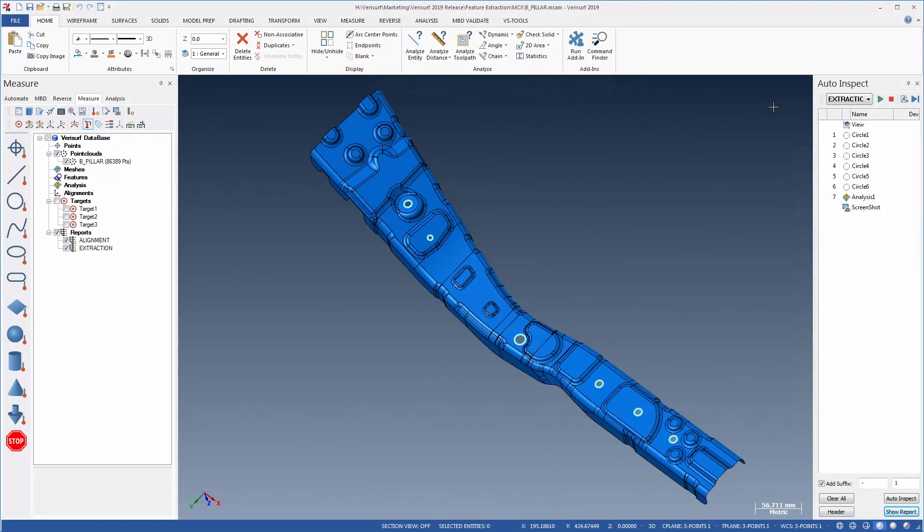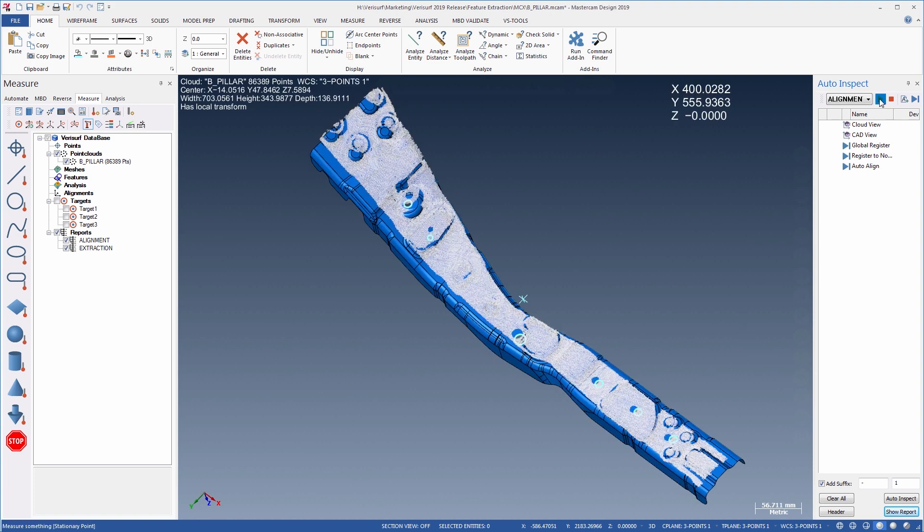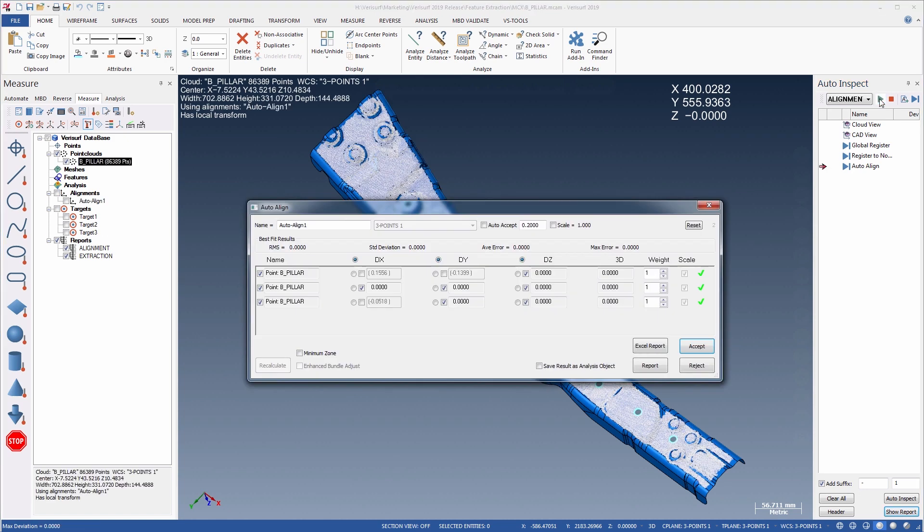Let's begin with an example of a sheet metal part that's been measured with a non-contact scanner to create a point cloud. We're required to check the locations of six holes and surface profile on the front of the part. We'll do this by comparing the point cloud to the nominal part model. VeriSurf will automatically extract measured circles from the point cloud for comparison. The point cloud is not aligned to the model, so we'll use an inspection plan to align the data. When we choose Run, VeriSurf performs a global alignment, registers the point cloud to the model, and finishes with an RPS alignment to the holes. The addition of global and nominal registration in VeriSurf Automate enables completely automated inspection workflows using non-contact scan data.